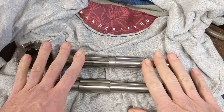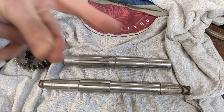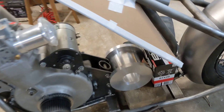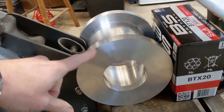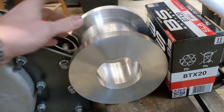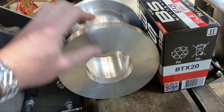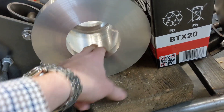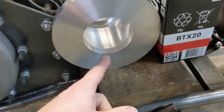So that's the shaft end of it. Other updates on the gearbox — just over here is the gearbox case. Now the gearbox case isn't finally finished to size, but it's pretty close. This is the cotton reel that was in the big Churchill lathe next door, and Bob's roughed it out mostly to final dimensions. This outside diameter can come down a fair bit, these bits need to be a bit thinner, and the inside edges here need to be just shaved a tiny bit.